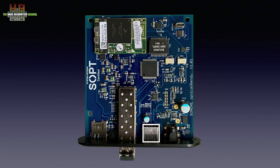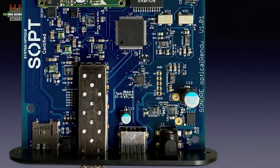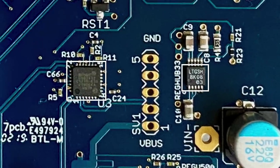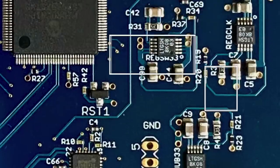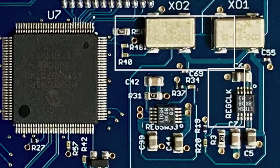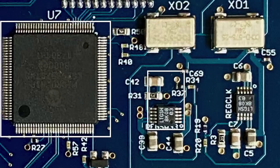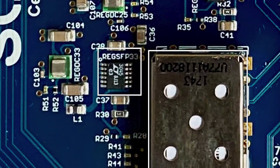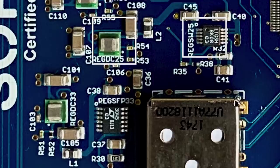Every individual function on the board has its own ultra-low noise LDO voltage regulators — like these two that seem to provide a general 5 volts DC. Then there is the regulator for the USB hub and the regulator for the crystal oscillators, which by the way are ultra-low phase noise Crystek types. The Ethernet switch module also has its own voltage regulator, as has the SFP cage, and there are even more of them — 11 in total.